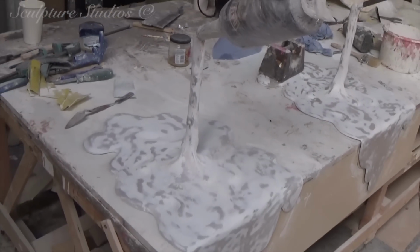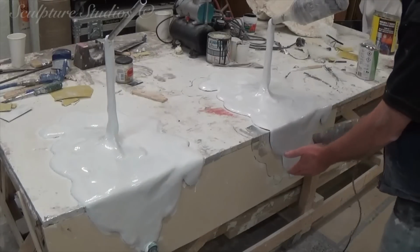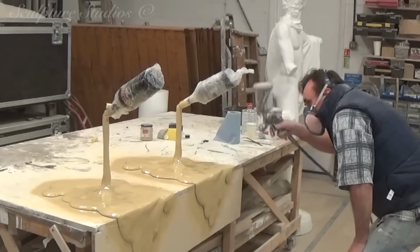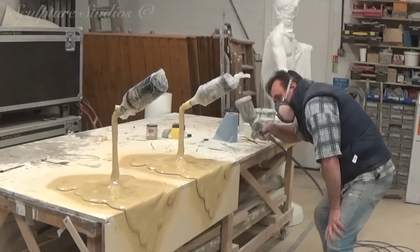We go over the job multiple times with sandpapers and fillers, buffing them up until they're ready for painting. For this job we're using 2K car body paints for a really solid finish, and even after we've gone on with a white primer first and then the Bailey's colour, we still sand it back again if we find any imperfections.